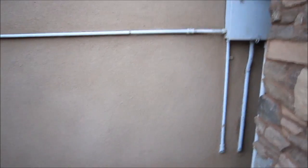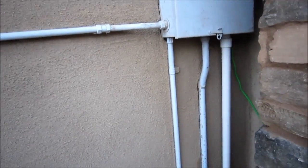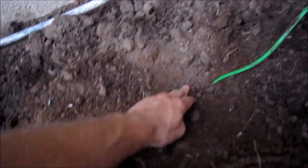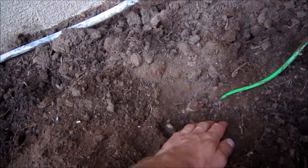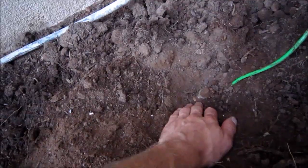When we got the electric car, I wanted to make sure it could charge properly. It could have charged with just neutral, but I wanted to make sure I had a good ground just for protection. So we put a copper rod into the ground and hammered it as deep as we could.